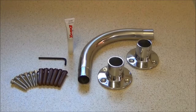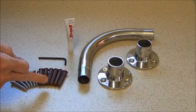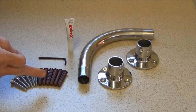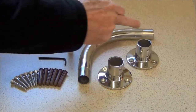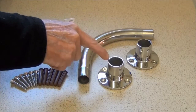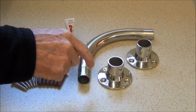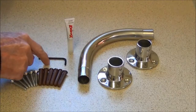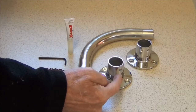When you open the kit and lay it all out, you'll see you have some stainless steel screws, some Thorsman raw plugs which are the best quality raw plugs you can buy, an allen key, some metal glue to glue these ends into the tubes, and then wall brackets which have three-point fixings to make them very strong. Once the tubes are inserted, use the allen key to tighten up the allen screws to hold the rail in place.